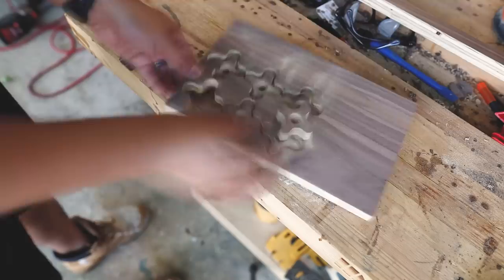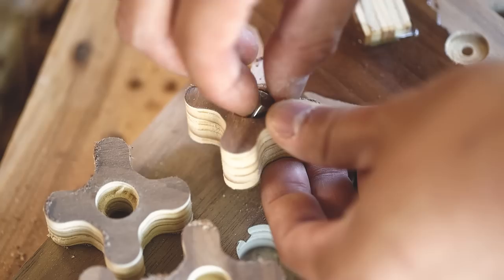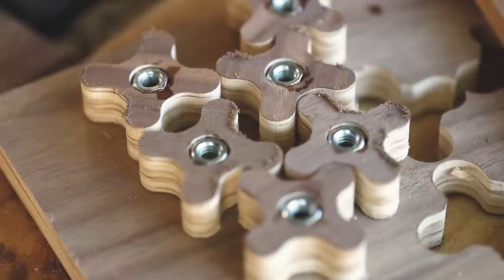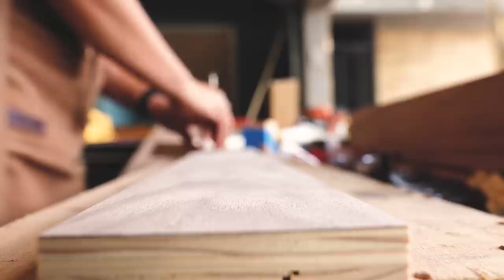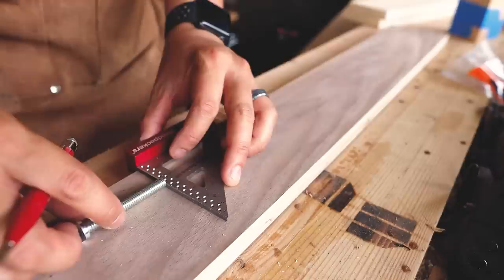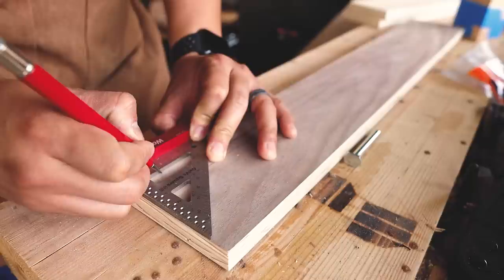I created little tabs to hold the knobs to the actual workpiece, so they're tiny enough where I can just simply pop them out and give them a little bit of sanding as needed. To secure the bolts inside the pocket, I'm just mixing together some epoxy. I will be using five-sixteenths threaded T-bolts, so I need to make sure the nuts correspond to the threaded pattern. I'm marking the location to cut out the slot for the bolts. The slot is offset from the center because I wanted more surface area for my router to sit on - that way it keeps the router stable and the knobs won't be in the way as I'm pushing the router through.